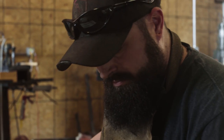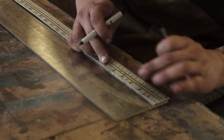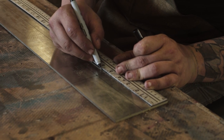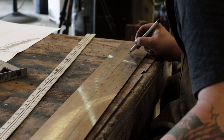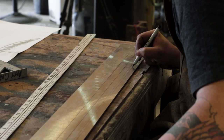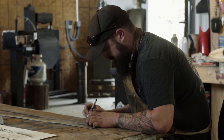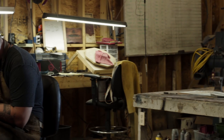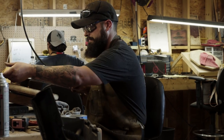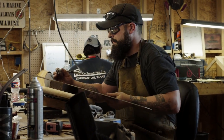The steel chosen for this project is 1095 high carbon steel. I took the general measurements and profile and drew it in with a scribe. I'll take it to the engravers and strike in my lines so that after I cut them out with the angle grinder, I can go to the KMG knife grinder and true up the profile.